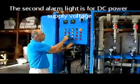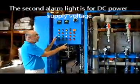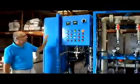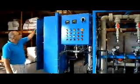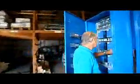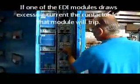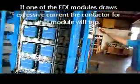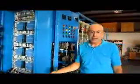DC power supply fault, similar function, but instead of looking at the EDI feed pump, this looks at the EDI power supplies in this panel. If for some reason one of these power supplies over here draws excessive current, it will trip an overload relay over here. I'll just pick one here. Now, the red light is on. We have a DC power supply fault. That's one of these contactors.